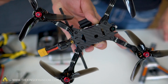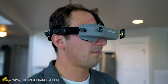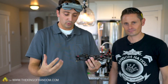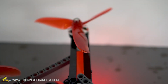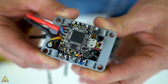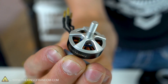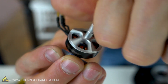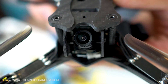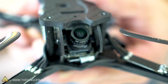On a drone there are a couple of main components that all work together — they're interchangeable kind of like computer parts. There are six main components absolutely essential to making a racing drone work. First is the flight controller — it's like a little computer that knows the orientation of the drone. Next are the ESCs, which give power to the motors and tell which motor to spin faster or slower. The third thing is the motors — lightweight, spinning up to 30,000 RPM with up to a 15-to-1 thrust-to-weight ratio. The FPV camera transmits to goggles so the pilot can see what the drone sees — it's like being inside the cockpit. The camera transmits in analog, which is actually older technology but faster to the goggles. If it transmitted digitally, the latency would be so large that the drone could crash before you even see it happen.